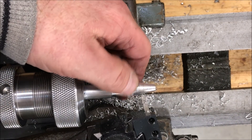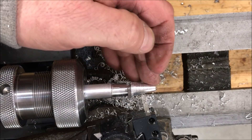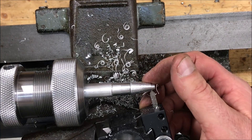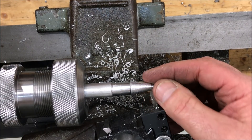My collar just broke, so I'm going to stop, make another collar, and then we'll come back and finish the taper cut. I decided to go ahead and continue turning without the spacer. That will allow this to lock tightly into the mandrel; however, we can get it loose, and I'll show you what I do when that happens.